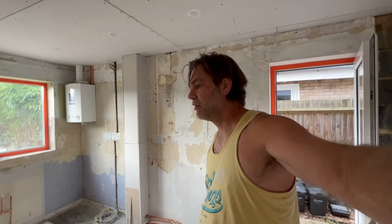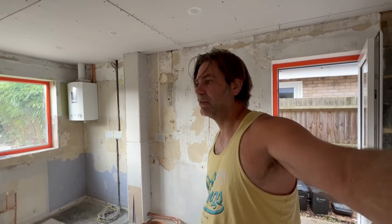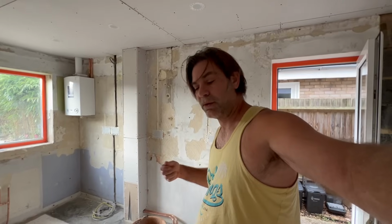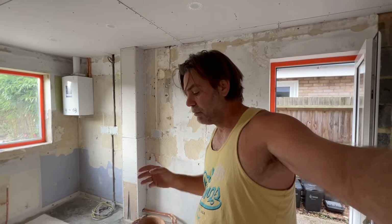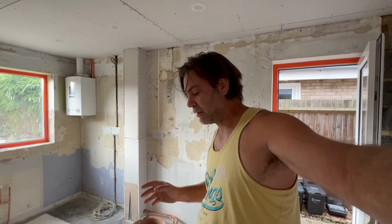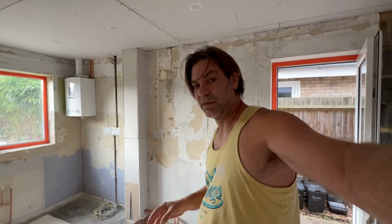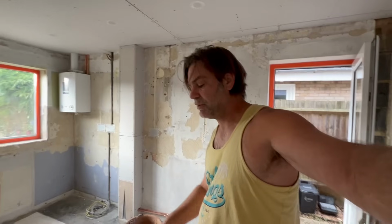So you want a quicker turnaround. If we put hardwall in there, we'll be waiting for ages for them to go off. Hardwall is easier for ruling off and things like that, for working with. Bonding's not very nice for all that. So yeah, if you don't need to rule, basically, bonding's all right. Oh, you can rule off of it as well. They both do the same thing. It's just bonding's better for this sort of stuff. Okay.